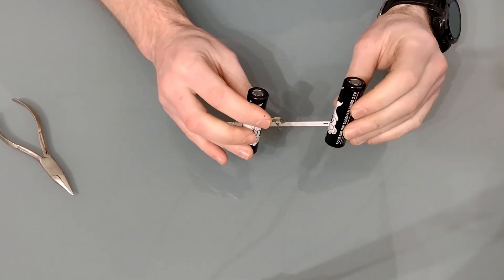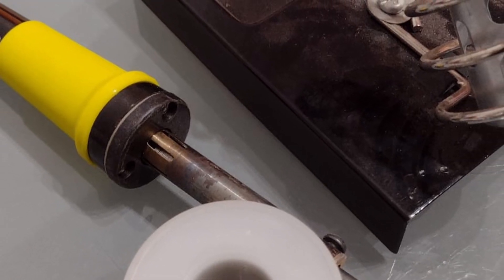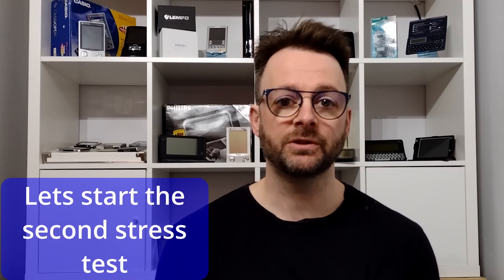Before connecting these batteries up let's talk about the different methods. The first option is soldering — this will work and provides a good connection. The only issue is that high temperatures from the soldering iron can damage the battery itself, reducing its capacity. If soldering is your preference, I'd suggest getting tagged batteries so you can put a heat sink between the soldering iron and the battery. I have heard of people wedging batteries back in using tinfoil or springs, but any knocks could disconnect the battery losing data or possibly cause a short circuit — I definitely wouldn't recommend this.